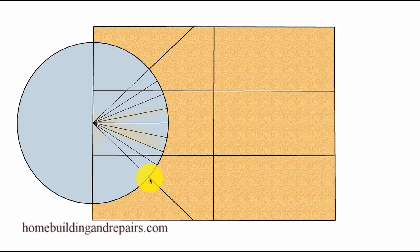Then we will need to measure the curved distance here. That can usually be done by simply running your tape measure across here and curving it as needed to measure the length of this line. If that doesn't make sense I can always make a video on that — let me know. You can also use a math formula to calculate this distance. Then we will divide that distance into the amount of steps we're going to have, and in our case we are going to have eight steps.